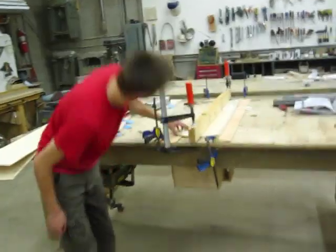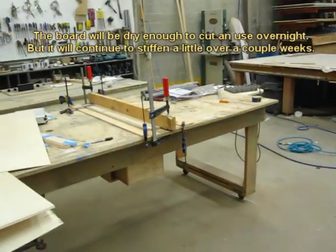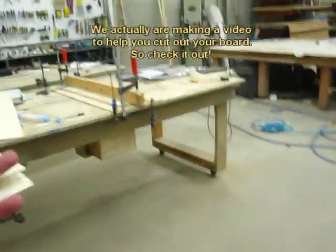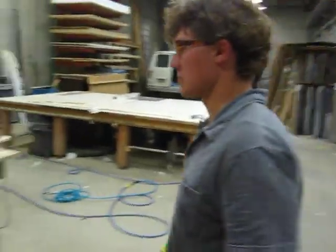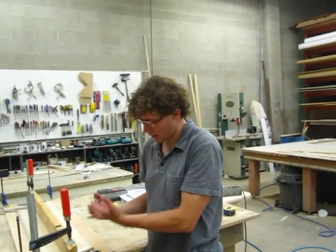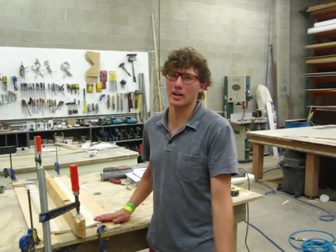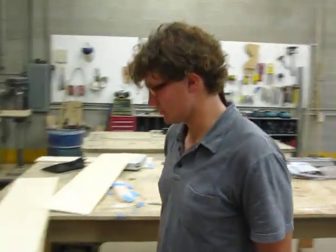It's pressed up and it has concave. We're going to let it dry overnight, then come back and cut it. That's all we're going to show you — you can figure out the cutting part and get creative with that. Basically, the concave is what provides extra strength, because of the strength inherent in putting that kind of curvature in the wood, and also the comfort of having concave pressed into your own skateboard.